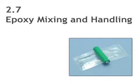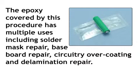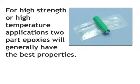This procedure covers epoxy mixing and handling. The epoxy covered by this procedure has multiple uses, including solder mask repair, baseboard repair, circuitry overcoating, and delamination repair. For high-strength or high-temperature applications, two-part epoxies will generally have the best properties.